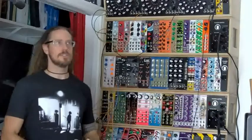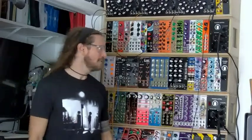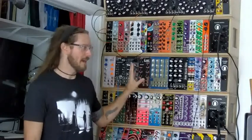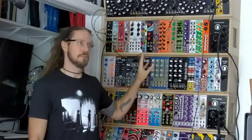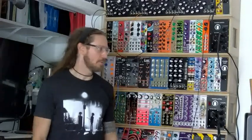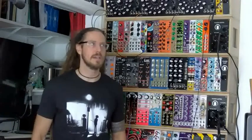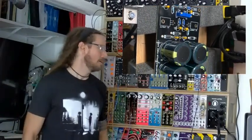There is so much discussion online about whether 12 volt is better than 15 volt. Go read it if you feel like it. I did 15 volt because most of the USynth modules use 15 volt, and practically all of the Music from Outer Space modules support 15 volt, sometimes by way of a small modification. For me, that was the most standard compliant way I could think of to do this, and my goal was to make it easy on myself. So I went with 15 volt.